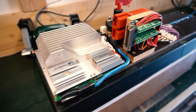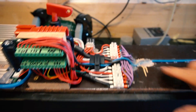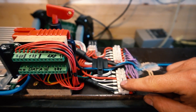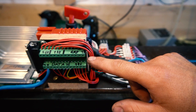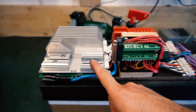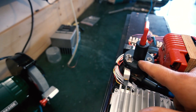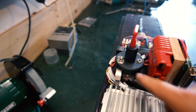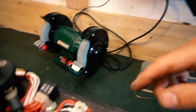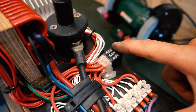And this is the battery pack almost done. This is the wiring coming from the cells into the BMS — the battery management system. Some custom aluminum coolers, a master kill switch, and a BMS enable switch. I also put in some car fuses for 12, 24, and 48 volt outputs.